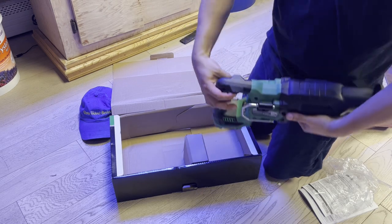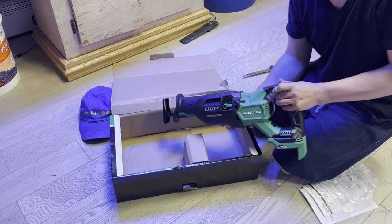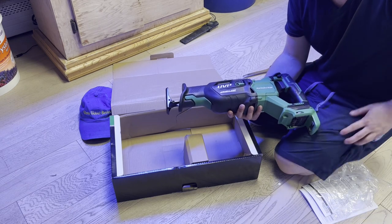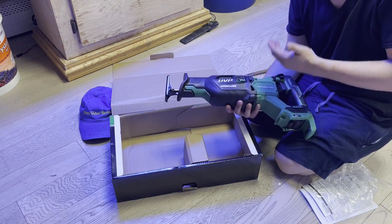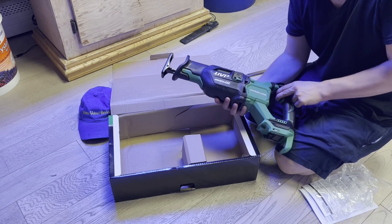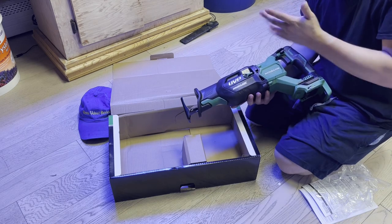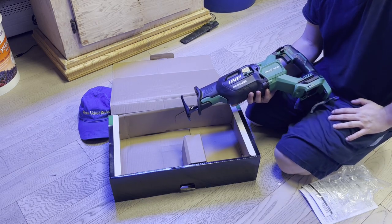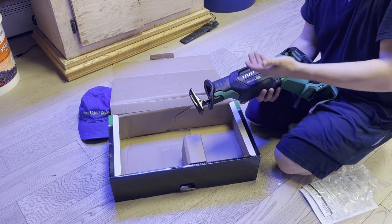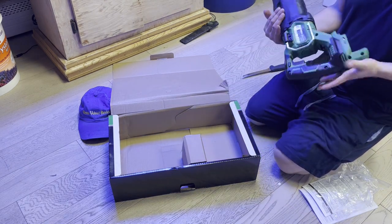This is the lock and unlock feature. One thing I'm a fan of with the Milwaukee Sawzall is that it has a lock in the on position — this one doesn't, so you always have to keep your finger on the trigger. If you're doing a lot of cutting for a long period of time, you get fatigued. It is a two-finger trigger, which is cool, but for really big jobs — cutting a lot of railroad ties or heavy material — I'd probably want the Milwaukee. It's more of a commercial-grade saw. But the price is more than double for a comparable Milwaukee kit with orbital, so there's that tradeoff.